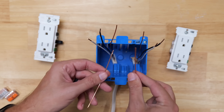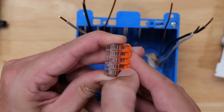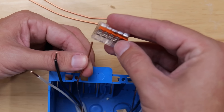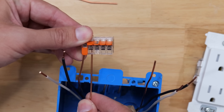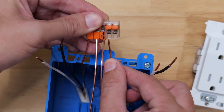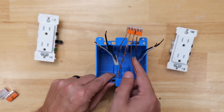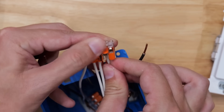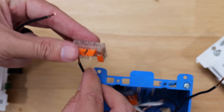With my two pigtails and my incoming and outgoing grounds, I flip up all the levers on the Wago connector. I insert my incoming ground into the first port, verify a good connection through the clear housing, and flip the lever down. I put the first pigtail into the second port and flip it down, then the second pigtail, and then the outgoing ground — all grounds now connected together in one Wago. I repeat the exact same process with the white neutrals, and then with the black hot wires: one port for incoming, two ports for the hot pigtails, and one port for the outgoing hot.